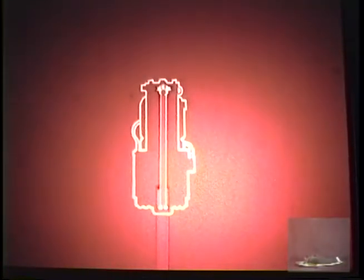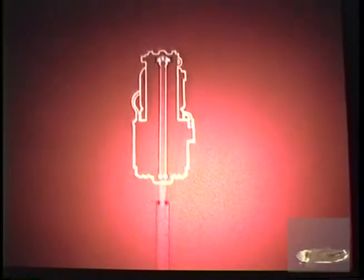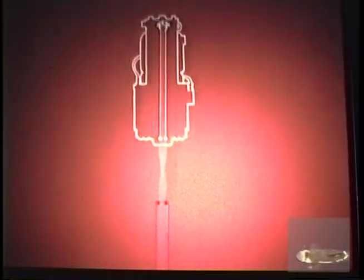The inner barrel hits the bushing, shearing the rivets, and leaves the ejection gun propelling the seat out of the aircraft. But let's go back about 1/2 second to the beginning of the ejection. As the seat moves up the guide rails, several things happen automatically. The occupant's legs are pulled back against the seat.